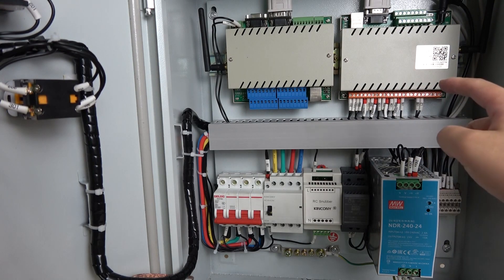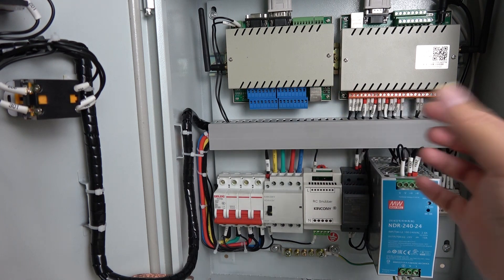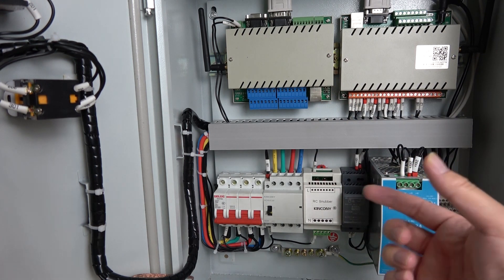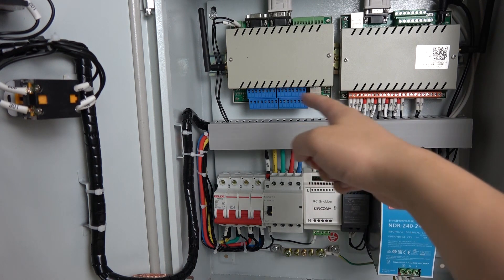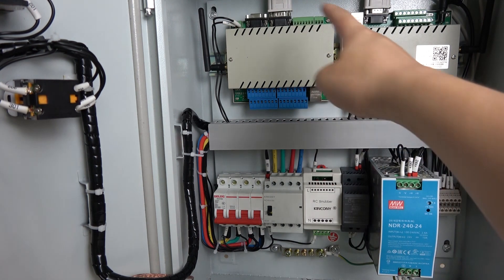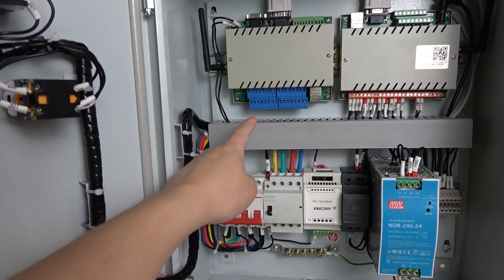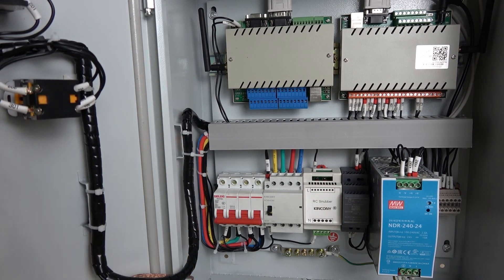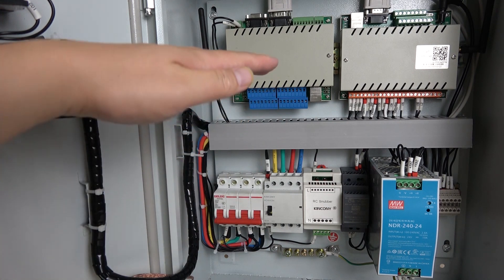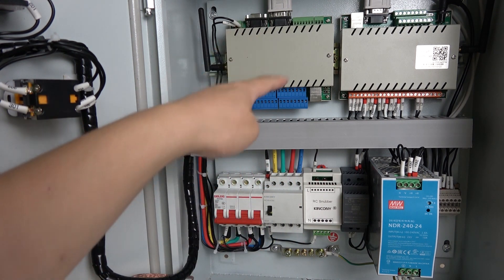So with this solution you can use your mobile phone to control the relay remotely. And also you can use the CLB mini version for time-schedule control — like every day when the scheduled time arrives, the pump turns on, and when the time arrives, the pump turns off. You can set every time schedule independently for the pump and the valve by yourself using the CLB PC software. And also you can connect sensors — digital input sensors and analog sensors. For example, if you want to detect your water level: when the water level is high the pump will begin to work, and when the water level is low the pump will stop. So this is for automatic control by the CLB mini version.